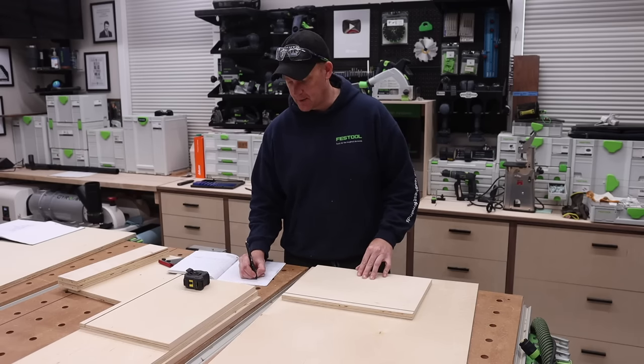A very common question I get is what screws I like to use for cabinets. I pretty much exclusively use PowerPro screws. The biggest reason is that they self-tap very well — in most cases no pre-drilling is required. Depending on the material, I can just drive the screw in and it doesn't split the wood. It dives in really well, countersinks itself cleanly. Typically on cabinet applications I will pre-drill, but the reference line is very helpful because it ensures I'm not so close to the edge that I might split the wood.